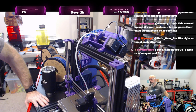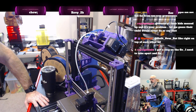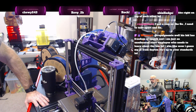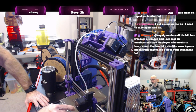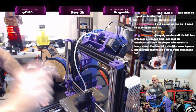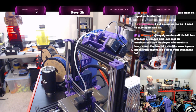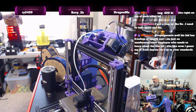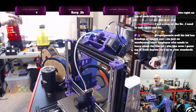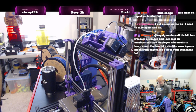The part that I hate is when I get a clog somewhere between the extruder and the hot end. Here it's all one assembly. On the Ender 3 over in the corner, I do have a longer amount of PTFE tube between the Micro Swiss all-metal hot end and the Sherpa Mini extruder on it, and I've had some nightmares with that one.